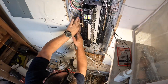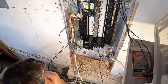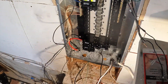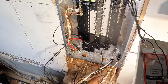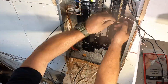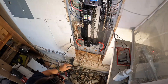You'll see shortly that I'm installing a couple of circuit breakers low in the panel because I know I'm going to bring in three-quarter inch PVC from the bottom for the electric vehicle charger circuit later. The conductors just barely made it, so instead of splicing I went right to the circuit breakers — those are both AC condensing units and the electric vehicle at the bottom of the panel. It does not matter where you pick up circuit breakers or where you plug them in on the bus bar.